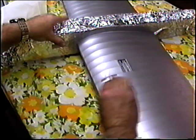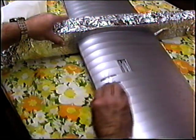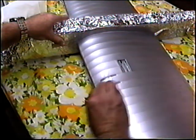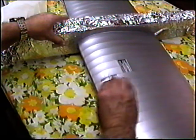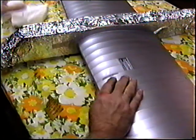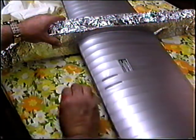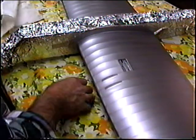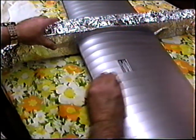In doubt, the best idea is to let it dry a little extra and put a couple extra coats on. As soon as you see you're getting close to going through, that's the time to stop. In fact, if you're in doubt, get even a couple extra coats on, because it's real easy to bury it in paint, but before you have enough paint on, it's real easy to go through. I just want to get the hair. I wouldn't even call this a sanding, I'd call this a defuzzing.